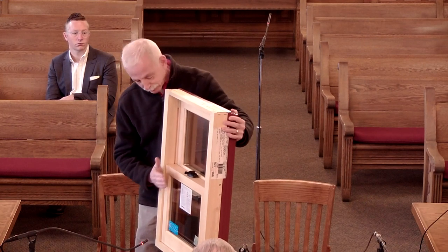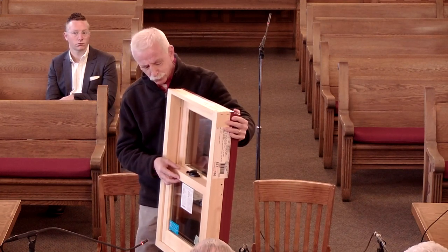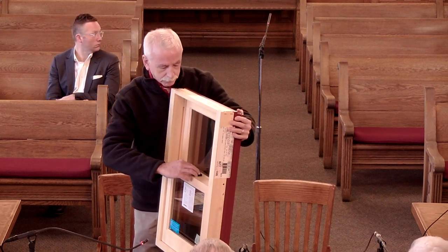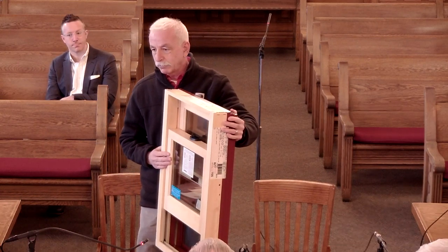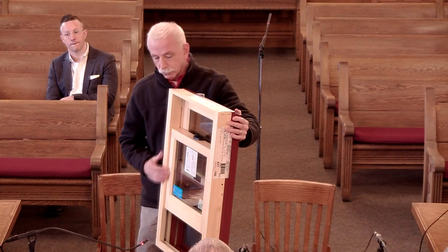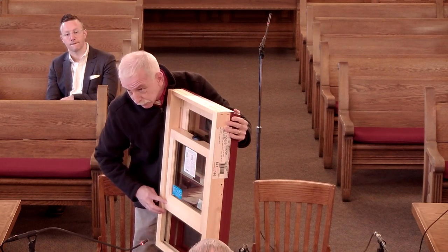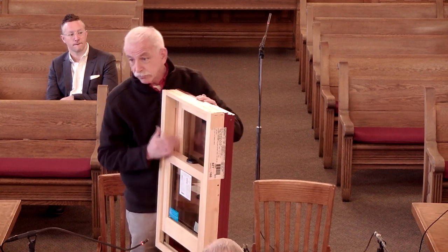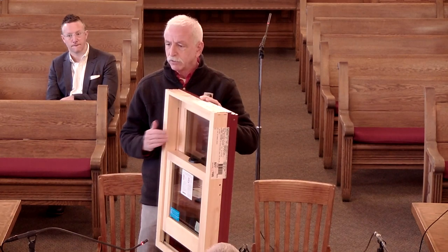This has much more wood to the interior than the fiberglass option — more so for an old authentic look. Is there a difference in thickness? Yes — the jamb on this would be narrower, about half the width of the one already approved. The approved window has a vinyl jamb liner; this one has a wood concealed jamb liner. So this is an upscale to what's already been approved.